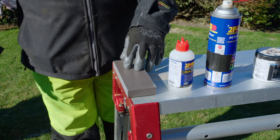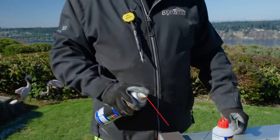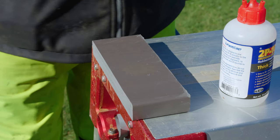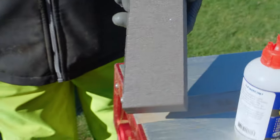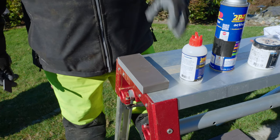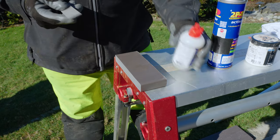I always put the cap piece upside down because that's the part I'm going to spray the activator on. Activator can stain PVC decking — if you're sloppy with it, it can actually yellow the surface. Can you see the color difference where I sprayed it? If you spray that on your finished side it might discolor, so you have to be careful how much activator you use and where you put it, or you can end up with a splotchy area that you will not be able to repair.